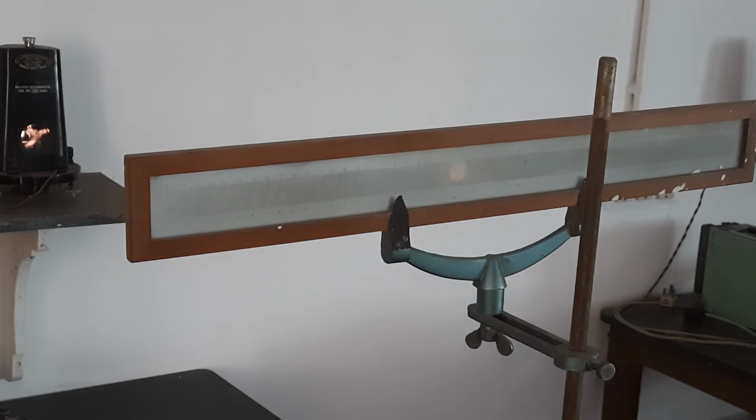You will be able to find out the sensitivity of your ballistic galvanometer, that is, per microamp how many millimeters are displaced on the scale. So per unit current, how many millimeters of scale displacement takes place, that would be the sensitivity of the meter. We can check it either through the observation table, or through the graph. We will see all these details in the graphical part and the script.